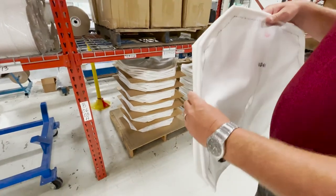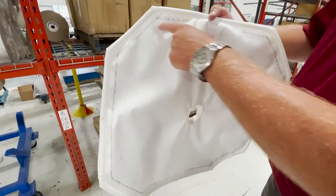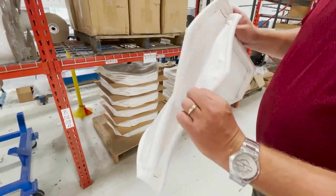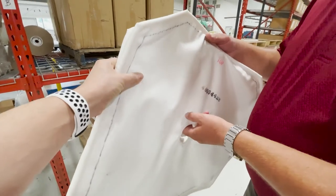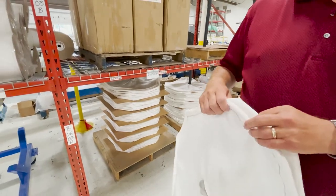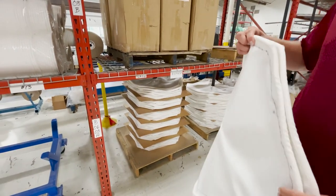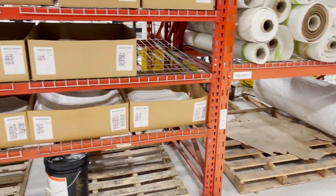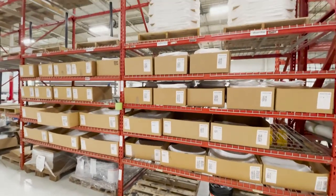For the CBD and cannabis industry, we do what we call an FDA cloth — we don't stamp part numbers on it or put marker marks on it. We'll only use a number two pencil for sew-line marks. The fabric itself is polypropylene — it's manufactured with virgin polypropylene resins and polymers, and our fabric suppliers provide us FDA certification on it. A lot of cloths for the metal finishing industry aren't FDA cloth, so this is an important distinction.